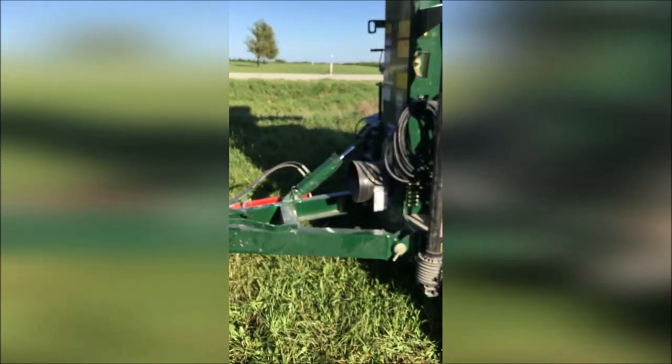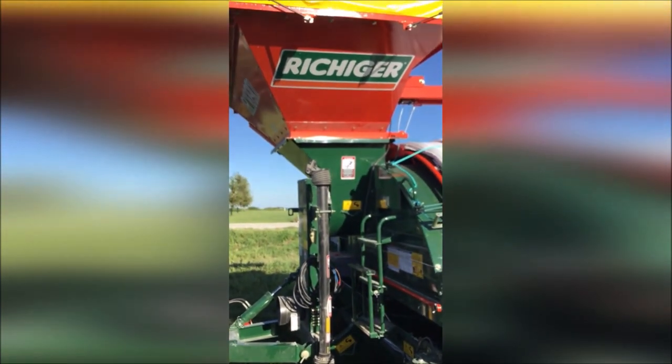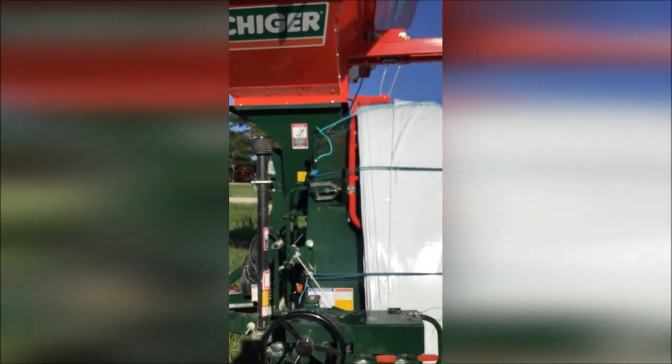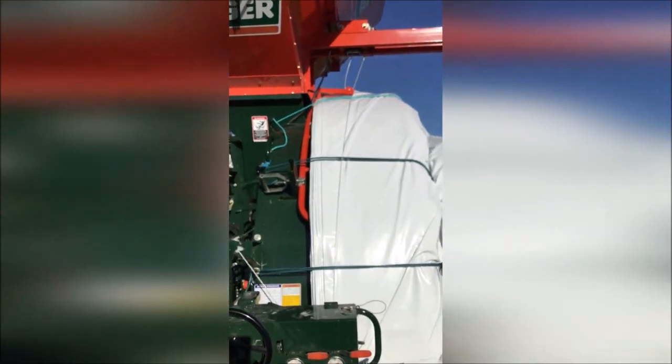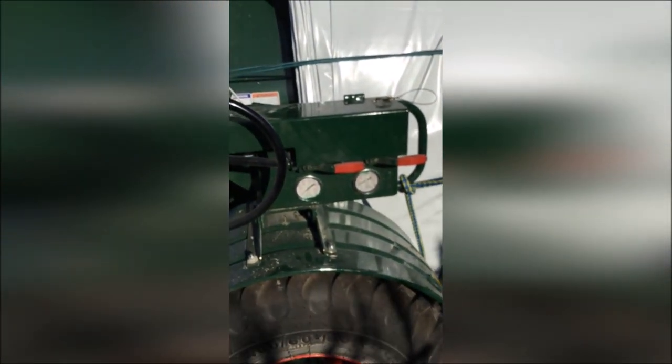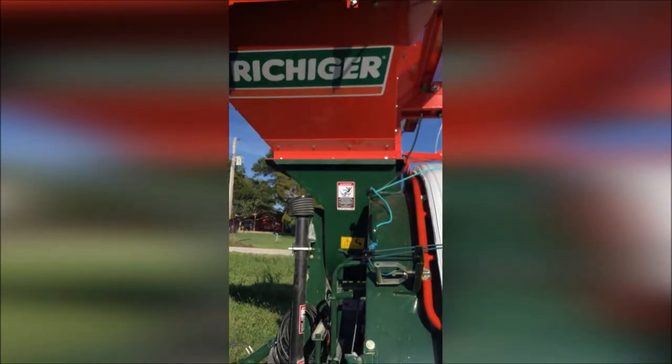The Richiger has a hydraulic cylinder to adjust the pitch of the machine from the cab. It's critical that when we start the bag, the machine is positioned slightly forward, so that once all the weight is loaded into the machine, it doesn't tip back and drag on the pan. Make sure stalks or debris are not dragging under the pan, because once they start dragging, our ability to manage the brake pressure and the pressure we put against the bag to manage stretch is altered. We can't manage what's being dragged underneath the pan, so proper clearance is critical. We manage all brake pressure from the station here with our hydraulic disc brakes. You can see this machine is positioned slightly forward.